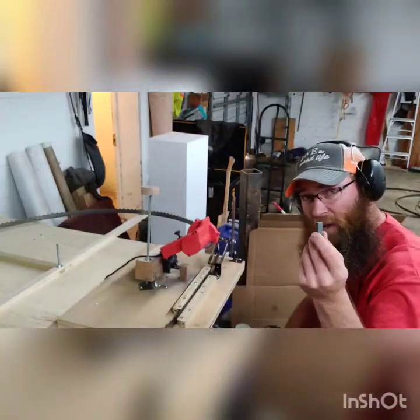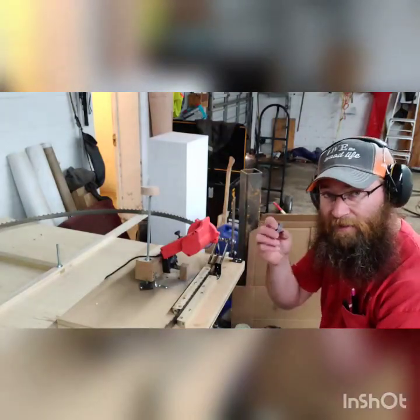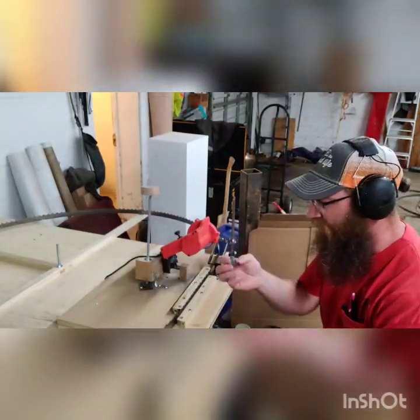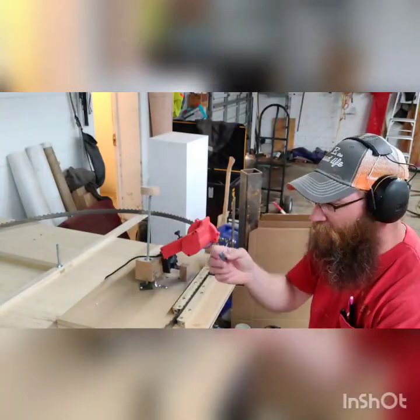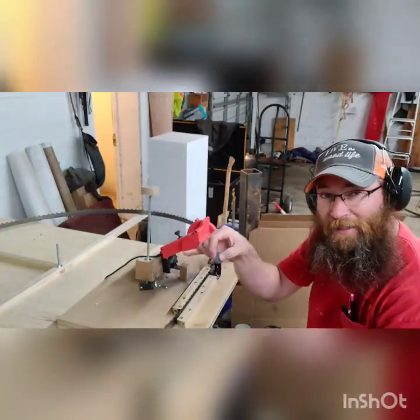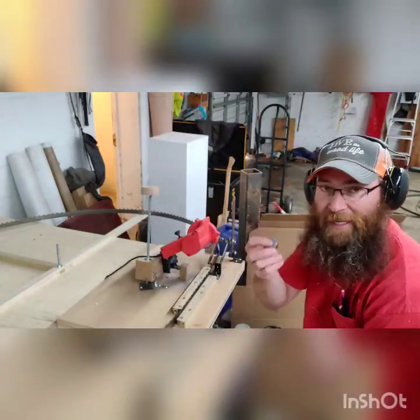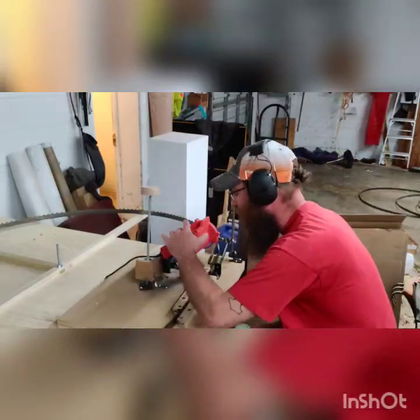As far as shaping the grinding wheel, which you have to do, this cleans it up, but it's just aluminum oxide stone that came out of my Dremel kit that you're supposed to use for cleaning and shaping the grinding stones that come in that kit. And I pulled that out, and that's what I use for shaping this. I'll show you that real quick.